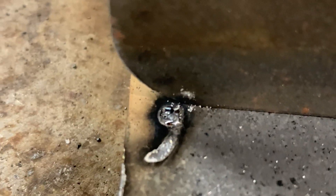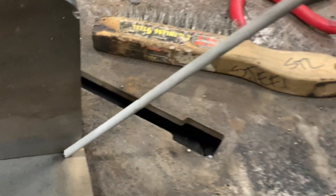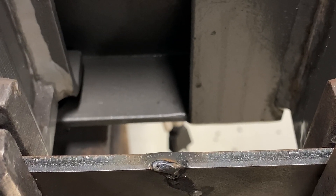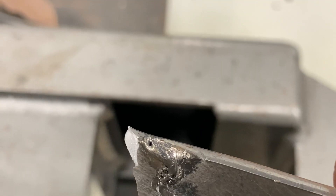Another cause is striking your arc or restarting — your rod sticks and you break it off, leaving an arc strike. To fix that, anytime your rod sticks, unclip the electrode from the stinger, grab it at the base, and just snap it off. That way you don't break off a bunch of flux and you can restart your rod. An arc strike outside of the weld zone prematurely heats an area and can cause stresses that aren't needed — especially on high-strength carbon steels. This is extremely critical and can cause failure even if the weld itself is great.